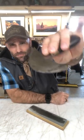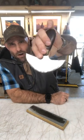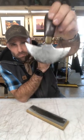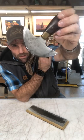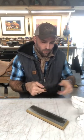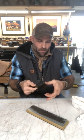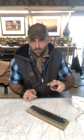You can see that oil is building up and getting caught. What's holding that oil in place along that edge is that burr I was talking about — it gives that fluid somewhere to hang. If we wipe this off and feel, you'll be able to feel what feels like a little wire edge. And when you've got the wire edge all the way around, you flip it.